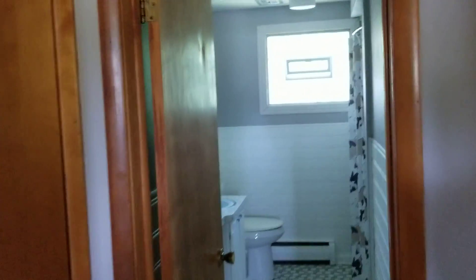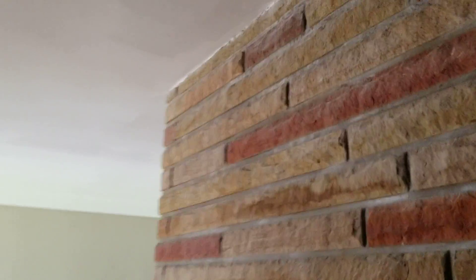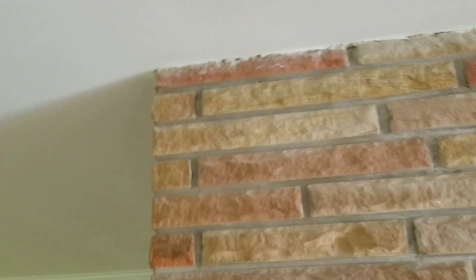This is a double awning. All of the windows are awnings and casements. The bathroom is glass block — it's gonna stay. Looking at the chimney, it looks like somebody did some drywall patch or something here at the chimney, so we've got to keep an eye on that. In the garage we've got a pull-down ladder that is in pretty bad shape — we're gonna want to give an option to replace that.